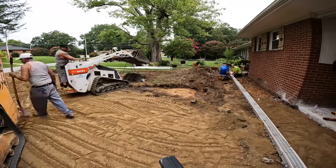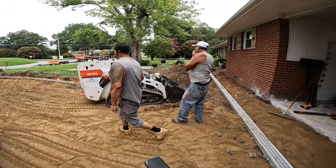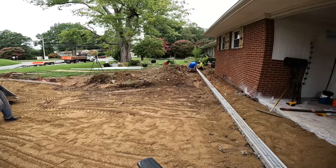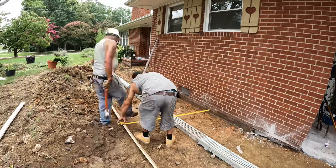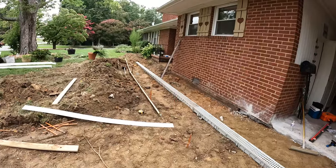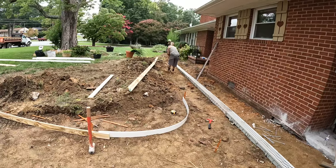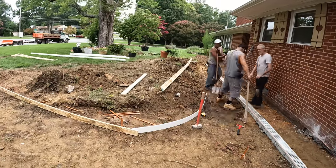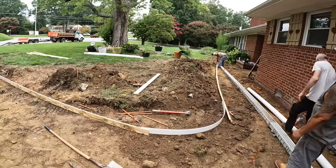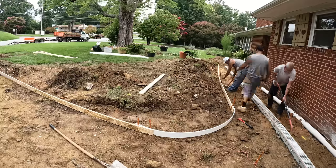Because we're redoing the concrete here, we can really control how the concrete's going to lay out, and we can get that going to our advantage. And so we're going to have a little approach at the street there, and so the water won't be running down the driveway like it did originally. We won't have to do that berm thing that I had to do before, and our channel drain is going to be sloping correctly away from the house and from the driveway into the channel drain. So everything is going to be good because we're now in control of where the concrete's going to be.